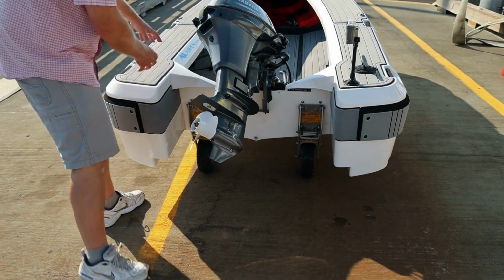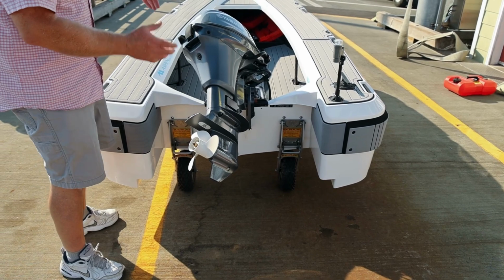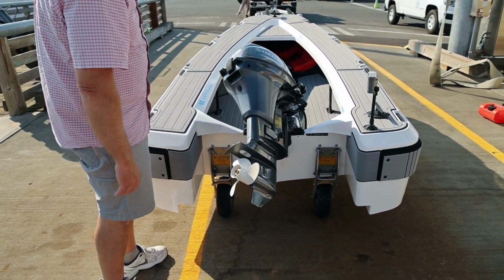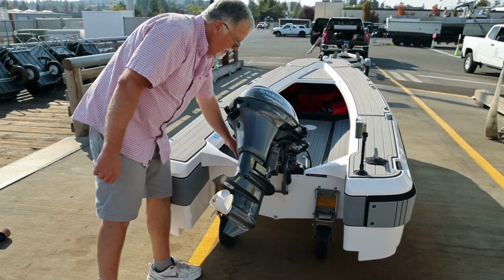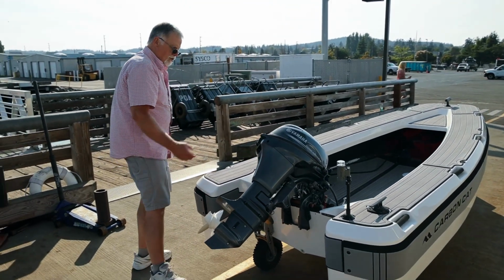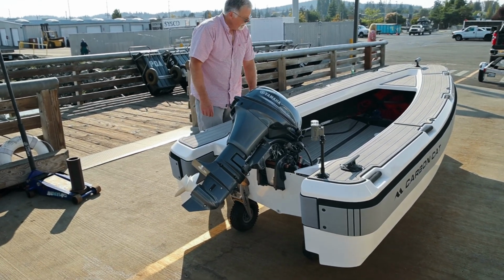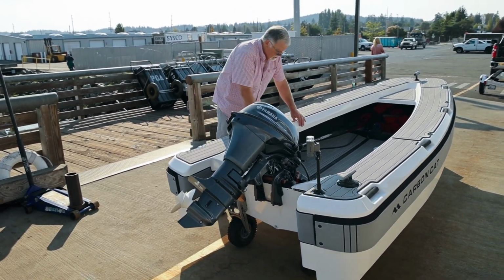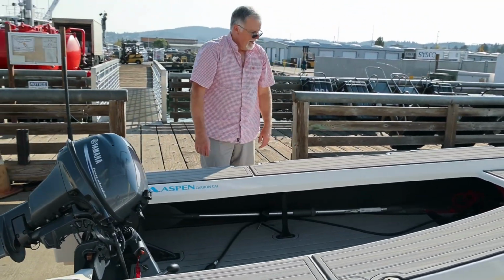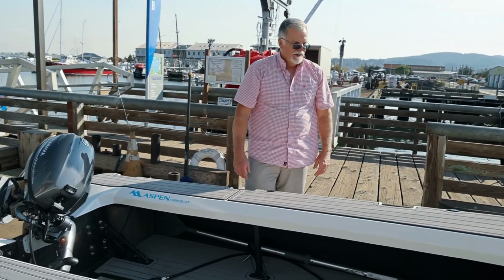You can see that the hull extends out past the transom, and that gives us reserve buoyancy here so that when you're crawling around with the boat or in heavy weather, there's buoyancy there to float the engine through. And the transom here is done with composite construction. We use a Coosa board material that's super strong, and then it's wrapped with carbon fiber and E-glass and vinyl ester resin. So pretty neat boat. You've got some support pieces here so the deck is real solid. And yeah, just a really special boat. Super strong, super light, really good in rough water. All right, let's go play with it.